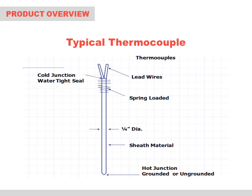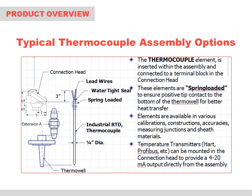A typical thermocouple looks like this. Starting from the bottom, you have the hot or measurement junction with a welded cap on the end. Lead wires are soldered on the back and a moisture resistant potting compound helps seal the back connection from moisture. A spring is added for use in a thermal well and can be removed if needed. Other options include the addition of a thermowell, a protective tube that is inserted into the process so that the thermocouple can be easily replaced without shutting down the line or process to remove the sensor. Various extension options are available to get the connection head up and away from heat sources so that the terminations can be made in an ambient temperature zone that is safe and convenient. Finally, an optional head-mounted temperature transmitter can be utilized to provide a 4-20 mA signal rather than running long distances with extension wires to a controller. These are just some of the packaging options available with a typical spring-loaded thermocouple.